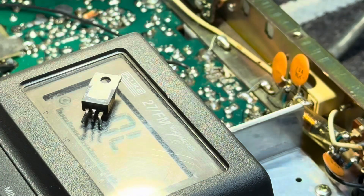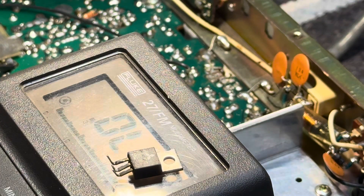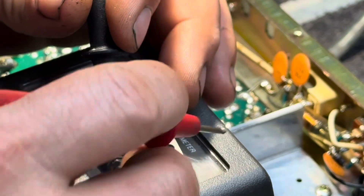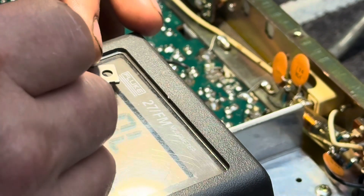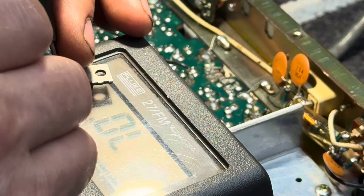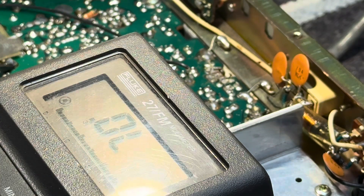So we know that the 1969 final is bad. We're going to check this 2166, which has a 1306 final for sideband — I think you can use a 2166 in place of it, and we're going to try it. That side works; we've got the same thing on the other side, and it doesn't go through the wrong way, so both those components check good. I also took time to check diodes on the board — even took a few out of circuit in the receive area — and they checked out good.